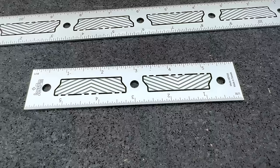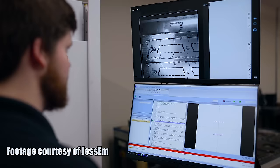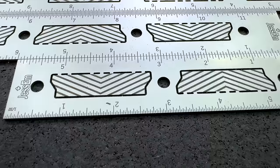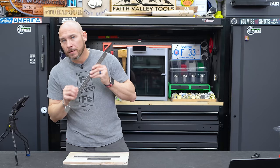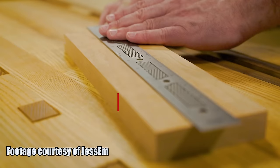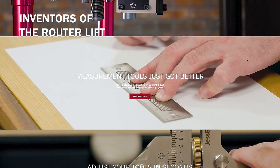This one is their new tool — it's a ruler, but it has a unique genius feature I've not seen on any other ruler on the market. The ruler itself is made out of 301 full hard stainless steel, so it's durable and won't rust. It has laser-etched markings that are extremely accurate — think woodpeckers-level accuracy. They dual-etch them so you don't have to worry about the markings rubbing off; you can literally feel the indentations where all those markings are.